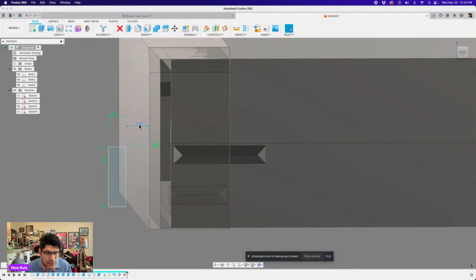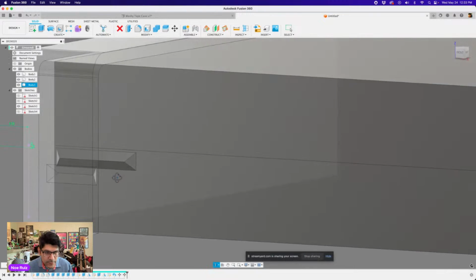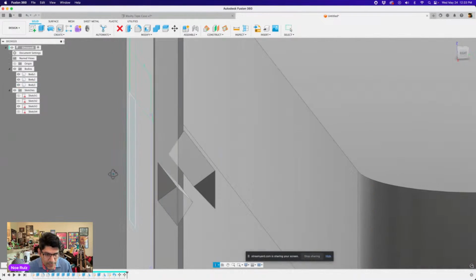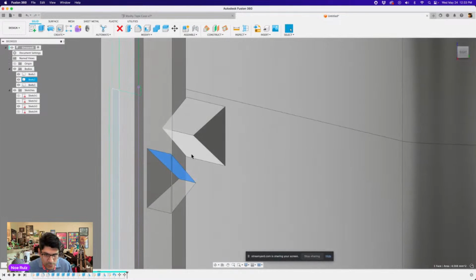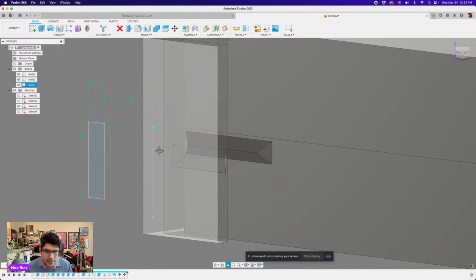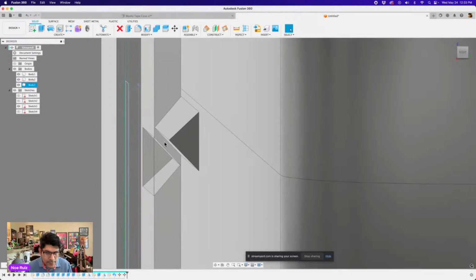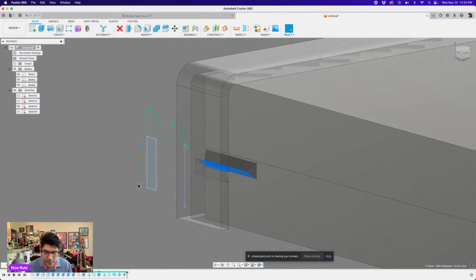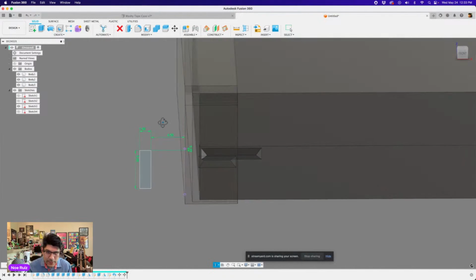And I'm going to change that 2 millimeter distance to something like 1, maybe 3, until I have a nice distance here. Let's try 4. And I can go in here and take a look. See what's that distance. I want a minimum distance of 2.2 millimeters. It's 0.5 right now. So let's do 4.5. There we go. It's looking better. And then there you can see we have a clearance between those two of about 2.2 millimeters. So that looks pretty good.